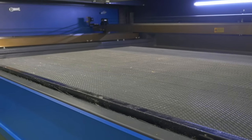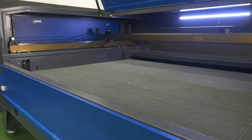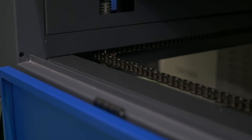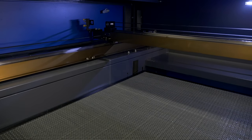The Watson 1610LT is equipped with a lifting and lowering mechanism, and the working area can be lowered to 160 millimeters. This allows machining materials of various thickness and installing a rotary device to work with cylindrical items, and also helps to adjust the focal distance.